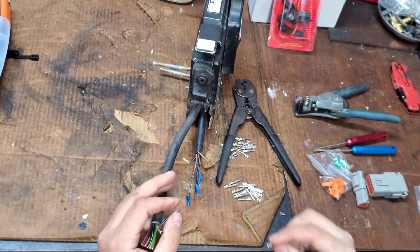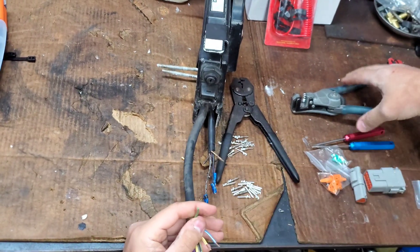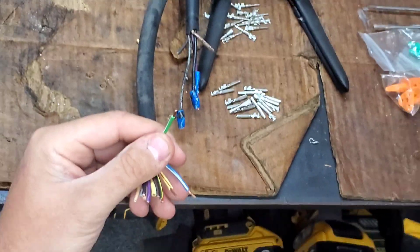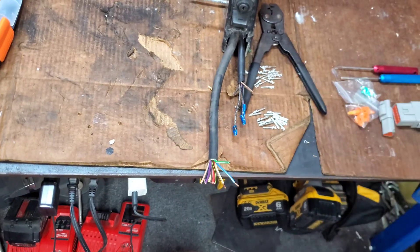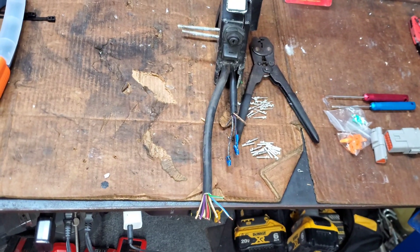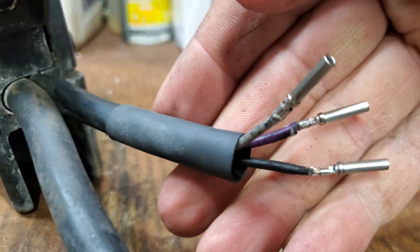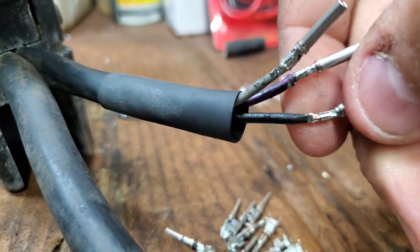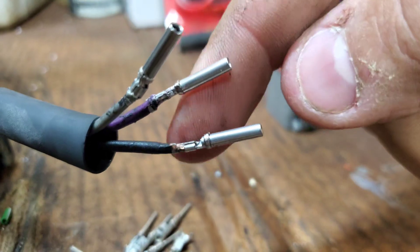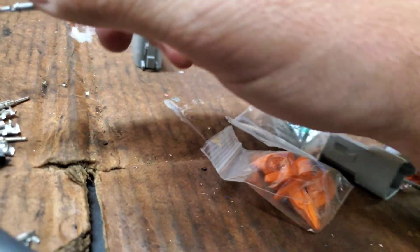I'm going to use the strippers here — I got these strippers 20 years ago. They hang up but just give them a little tap and they'll go. I'm going to strip all these back, get the soldering iron out, and start tinning them all up. As you can see we've got the pieces here. That little tab on the purple wire — you can see the tab there — you can see how it pinches the insulation of the wire, and then the second tab is crimped on the wire. You ain't pulling that off — that is a good strong connection and I've already tinned all the wires.